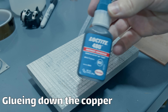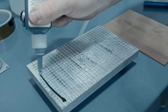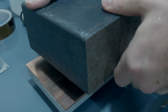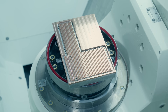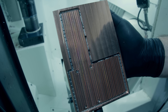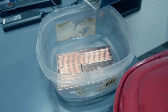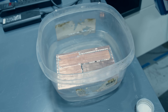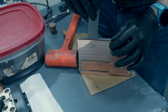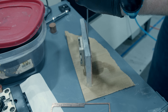Next up is the heat sink. I'm going to use a super glue fixture for this part — basically a piece of metal with grooves cut in it that allows us to press the sheet metal down so the glue can squeeze out into the grooves. We get good metal-on-metal contact, with plenty of space for the glue to hold. It's a really robust method. The super glue I'm using dissolves in acetone relatively quickly, and it's rubberized, making it a bit tougher. Parts typically come off after 24 hours in acetone — you can also heat it to speed up the process. I used too much glue on this part and it was a pain to get off, but eventually we got it free.